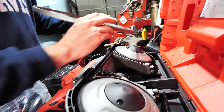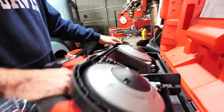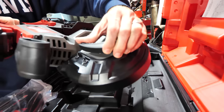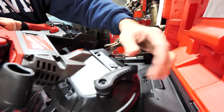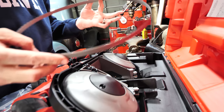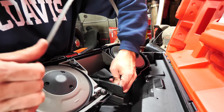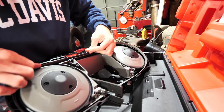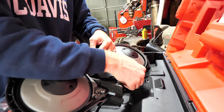Pulling out the blade — it comes with one blade. I have a smaller version of this at work. The way it works is you have this little blade adjuster right here; you open that up and it releases the tension so you can install the blade. It goes in here, then slips around the belt and the drive wheels — this is the belt drive system.